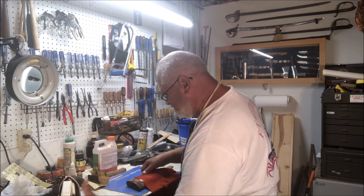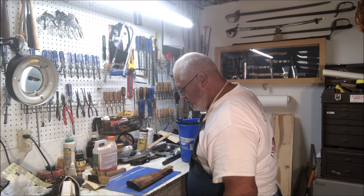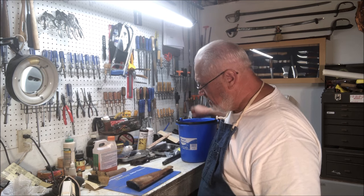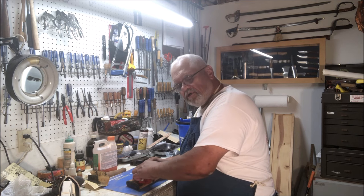Now, if you've got wood that's been actually taken away — gouged out — it's obviously not going to work. The wood's not there anymore. You can't replace wood that's gone by steaming. But if you've got dents, you can soak that stock down real good.